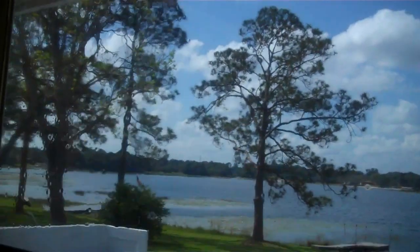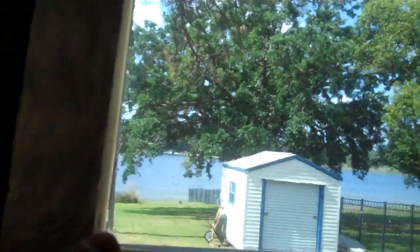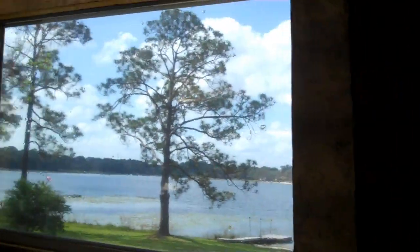There's nothing like putting film on a window to find all the little spots of dirt you've missed. Also, buying the cheapest film on Amazon means you might have marks in the film — the first several layers of the roll have a repeating mark, and I have a scratch I thought was a hair but it's actually in the film. The closer I get to the center of the roll, the better the film behaves. If you have enough film, consider throwing away the first several loops to protect from scratches from shipping.